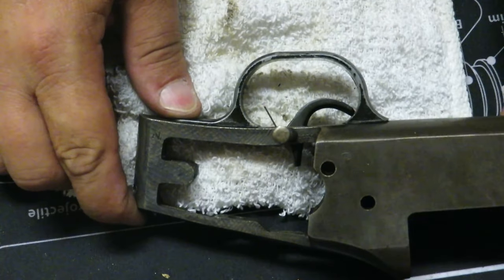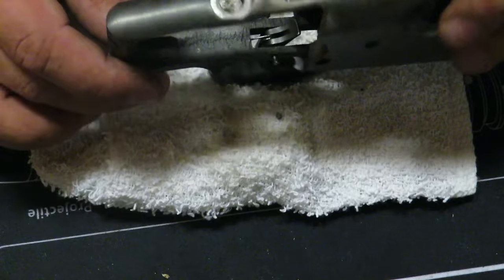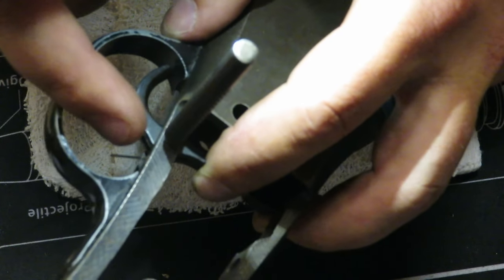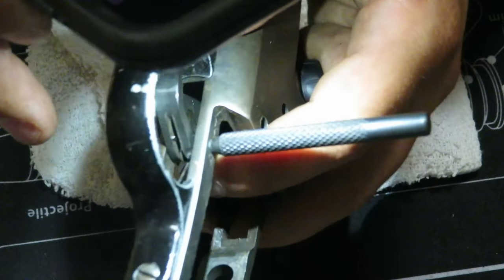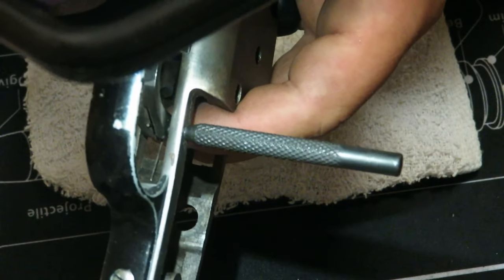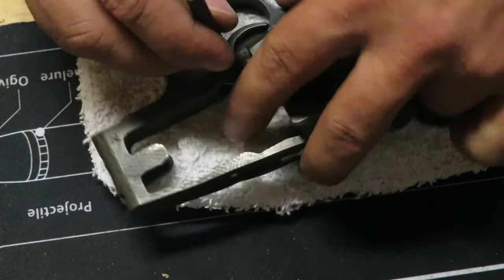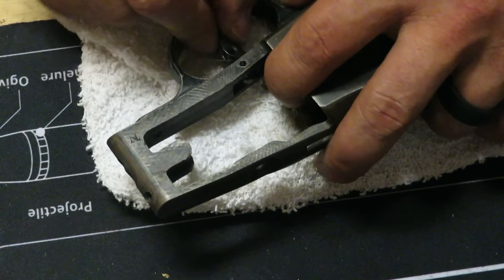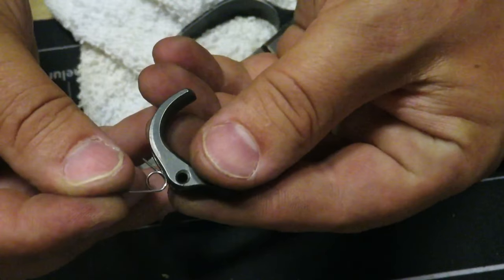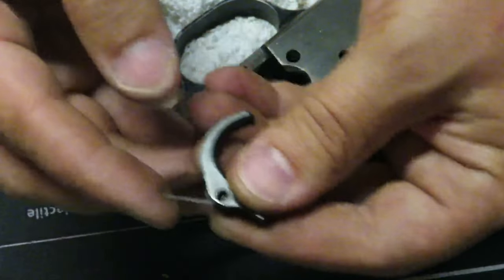That pin came out the bottom. Remember, just like every trigger, this is under tension, so leave that in there so you can see the orientation of the spring. The longer side is the other end of the spring — long end goes back against the receiver facing the trigger guard, short end goes into the trigger. Go ahead and pull that out, slide the trigger down and out. Long end of the spring goes towards the receiver, short end goes into the trigger itself, and this sits underneath the receiver closest to the trigger guard.